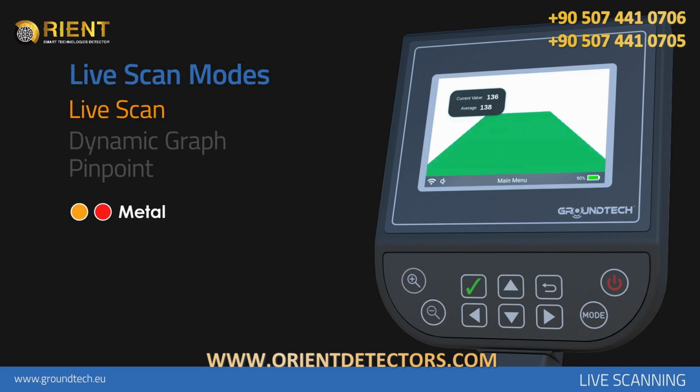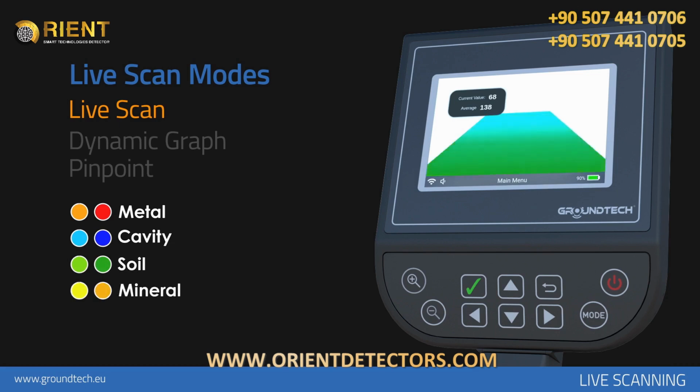On live scanning, you can see all metallic objects and most of the objects that have magnetic effect with red, and some objects that have magnetic effect with orange. Tunnels, filled dirt, and cavities underground with blue. Soil that had no changes or anomalies with green. Mineral soil and objects that have relatively low magnetic effect are yellow and orange. Additionally, you can see soil balance values and numerical values of instant data on the top left corner.